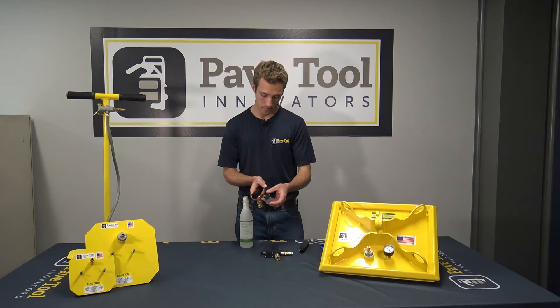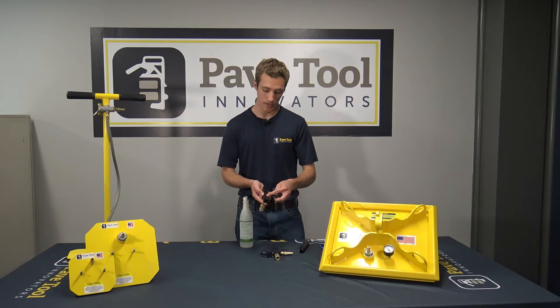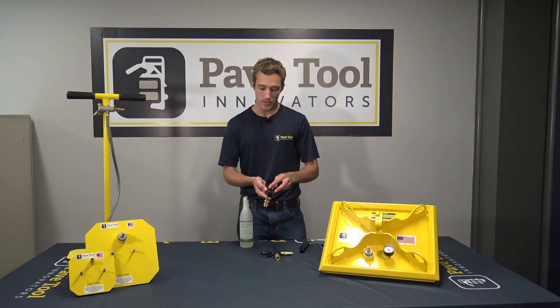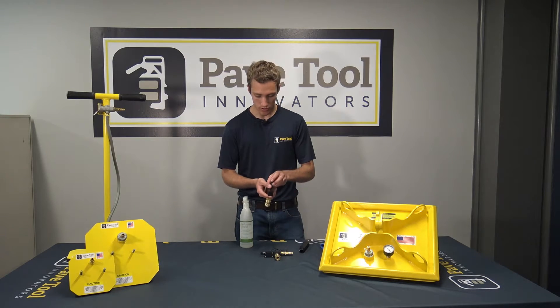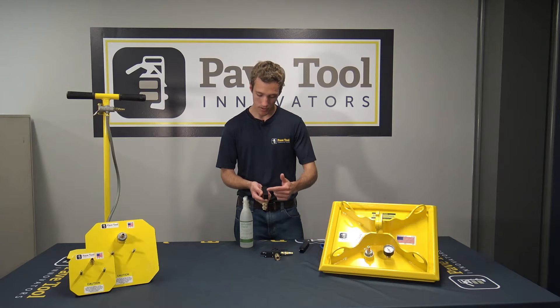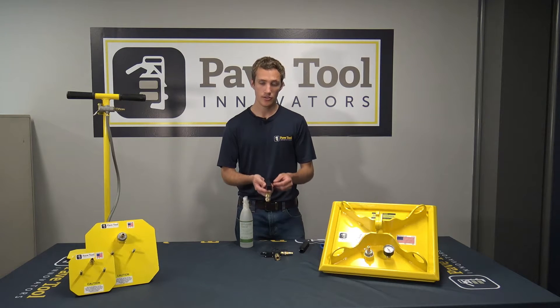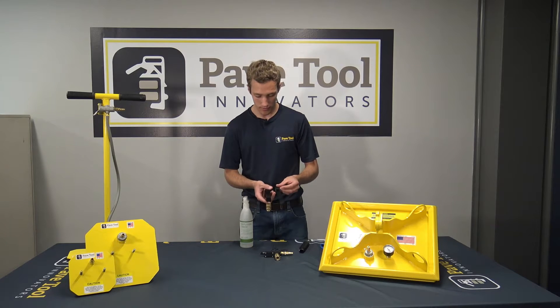This inside piece is a gasket, and it's designed so that this multi-stage Venturi creates the vacuum needed due to the different porosities of the product. When you open this up after using it for a season, it will be all covered in dust. Usually the reason for loss of vacuum is actually these little flaps here.